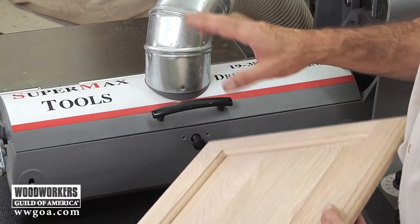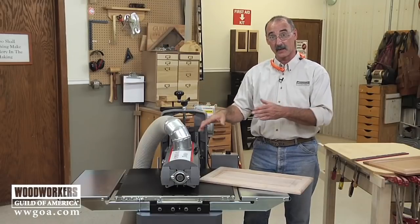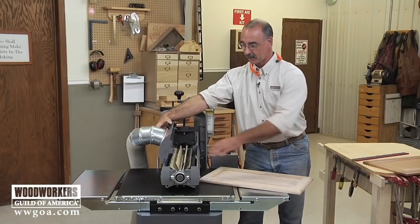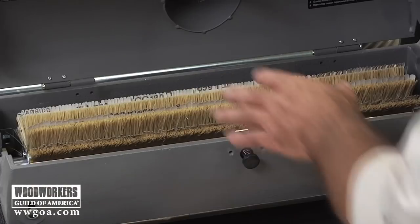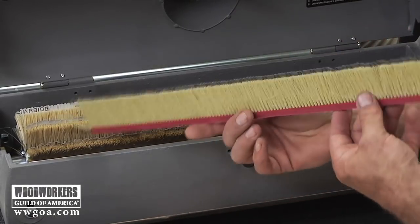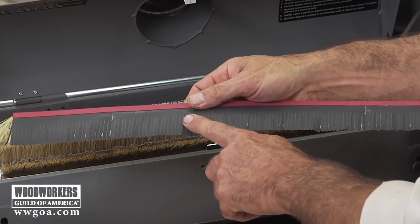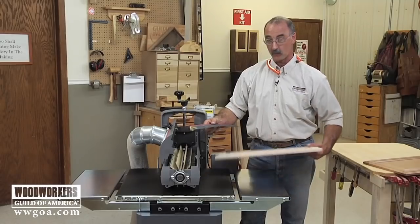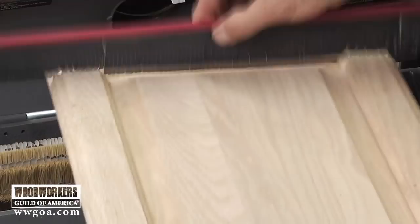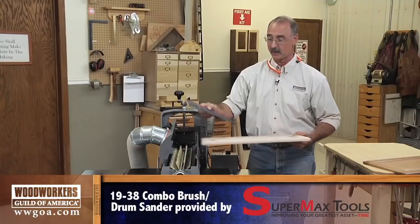Machines like this can make this a lot easier. Looking at this machine you might figure this is another surface sander that's got a sanding drum in there, but let me show you where it's different. This is pretty cool technology. It's got fingers in here with abrasive on them. I've got one that's out of the machine so it's easier to see. You're looking at the backside - that's the brush - then on the front of that there's an abrasive strip. You can imagine how this is going to go when I run my door through here. This is going to be able to flex down into the profile and reach right down in there and do that sanding for me, even in complex profiles like this.